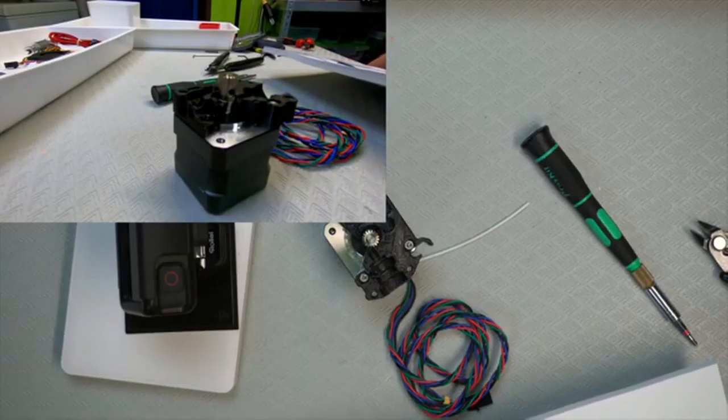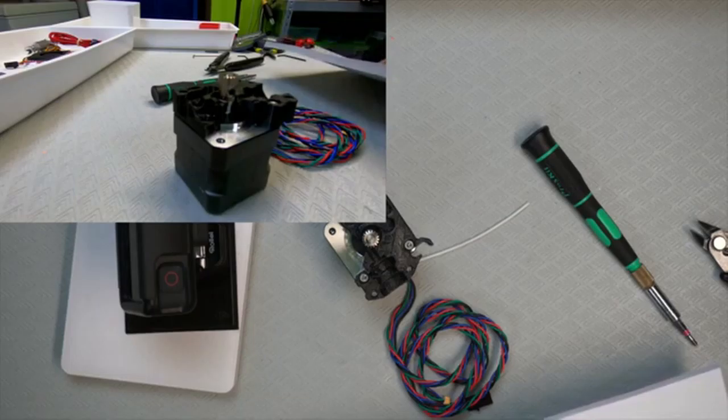Take a piece of 1.75 filament. Yeah, I got that. Blah, blah, blah. Filament on path, always slightly bent. Use it anyway for initial alignment. Final check, replace the filament with Allen key. Bear in mind the key is slightly different size than the filament. Tighten the screw slightly to temporarily fix it. If you don't make the final check, tighten it later. Be careful, you can strip the thread.